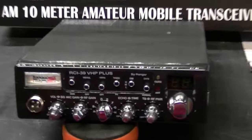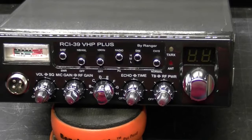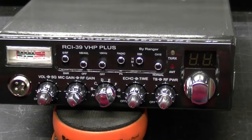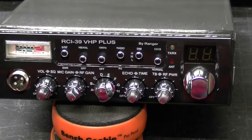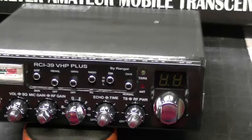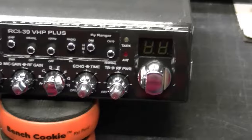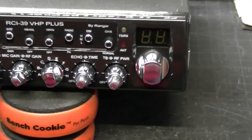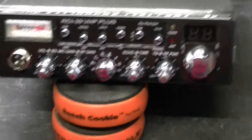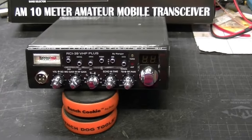As we zoom into the front of this radio, you've got your volume, squelch, mic gain, RF gain, your bands of frequencies, echo, reverb, variable talkback, variable RF power, all your noise blankers, and a three-position dimmer. It's got a lot of features. It's a glossy black front with a white S-meter, and a front four-pin standard mic pin — pretty standard features but in a different package.